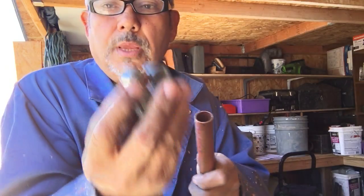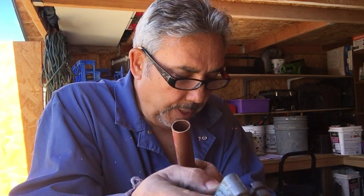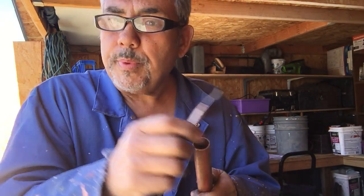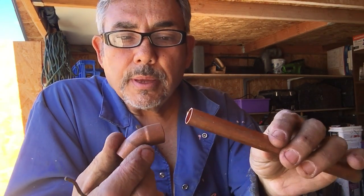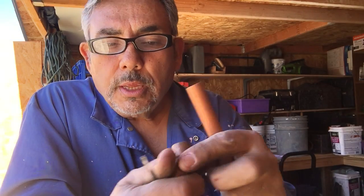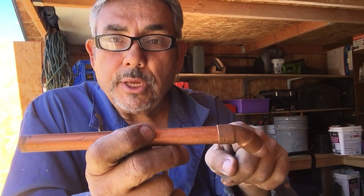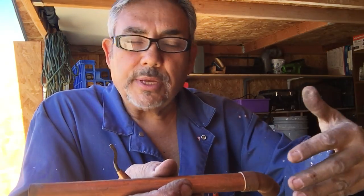For cutting the copper, use a copper cutter tool. There are electric tools that are fine, but don't use a hacksaw or a sawzall — use a copper cutter. When this fitting goes into this pipe, you want a good connection and a straight piece of pipe to butt up against the inside stop. You want proper flow so water goes in smoothly. If you've got an improper cut with burrs, you're going to get turbulence — that's why people say they've got wild noise and banging in their pipes.